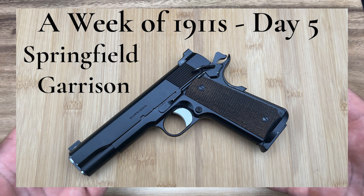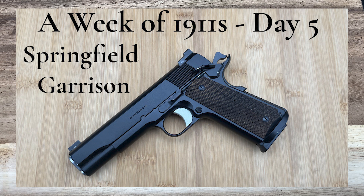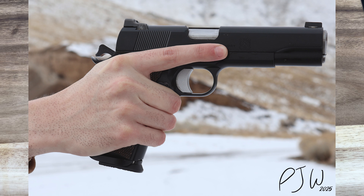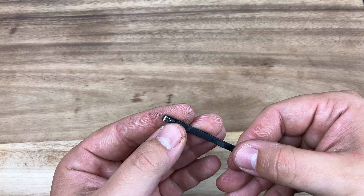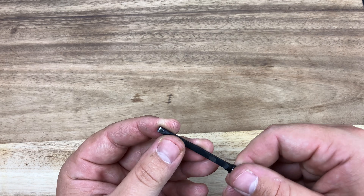Logan's Garrison — I'll throw up a picture here since I don't have it with me. Logan did a ton of work to that gun to make it work a lot better. The five-inch nine millimeter platform is kind of prone to sluggish feeding and reliability issues. Logan ended up replacing the extractor with a Wilson Combat Bulletproof one, but it still required a good bit of tensioning because of how nine millimeter extractors are in general. Logan also had to do some cutting on part of the claw assembly and I believe some beveling — Logan can correct me in the comments if that's not the case.